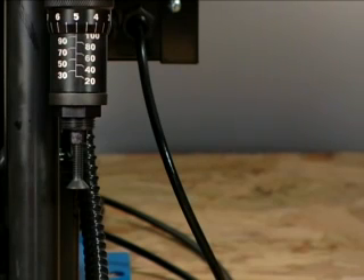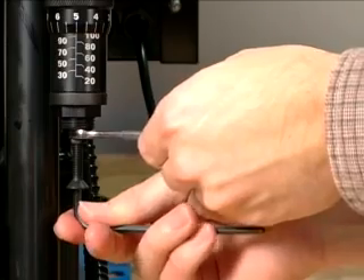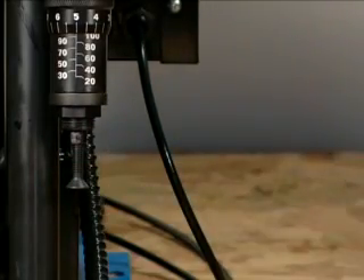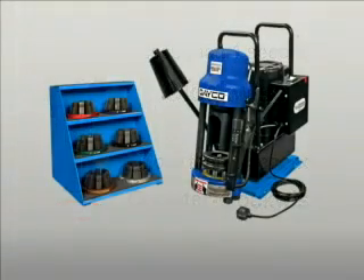Recalibration is accomplished by adjusting the actuator in the micro crimp adjuster. To make this adjustment, hold the micrometer barrel with a 5/16th open-end wrench, then rotate the stem either in or out with a 5/32nds hex key. If the time from which the pump started to build pressure was less than one second, rotate the stem clockwise. If the time was greater than one second, rotate the stem counter-clockwise. Once correct calibration has been verified, the machine is ready for crimping.